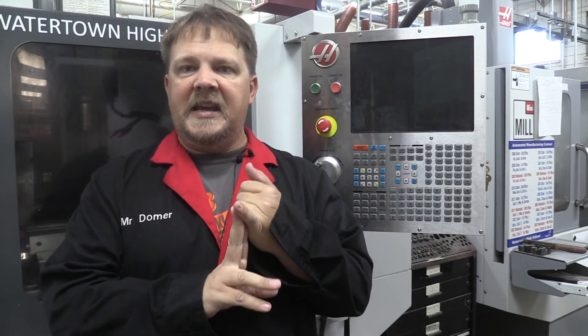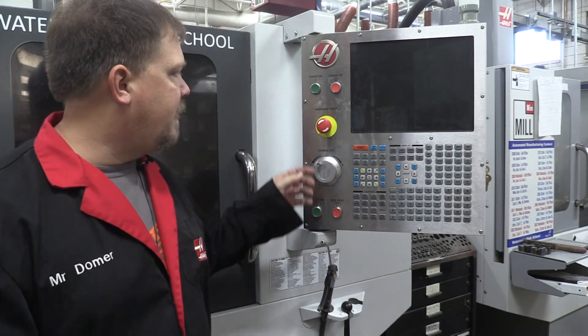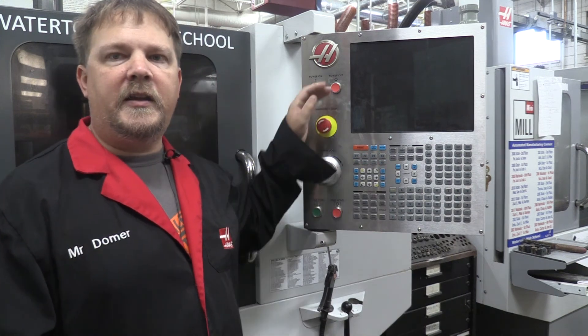In this brief video, we talked about how to turn on the Haas, get it set up and ready to go by clearing errors, doing the door and e-stop checks, and performing a power up restart to get everything back to zeros. We took a brief look at moving the table and spindle using the hand jog setting, and then covered the shutdown procedure: power up restart, e-stop, and power off. Hopefully this basic video gives you some comfort starting your first project — the next video will cover loading tooling.